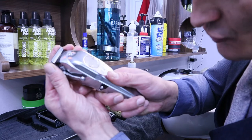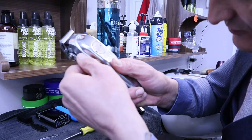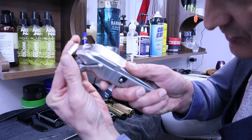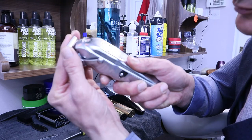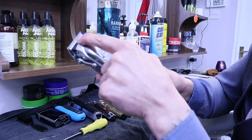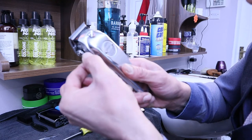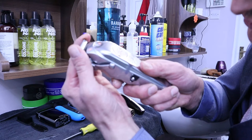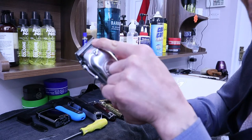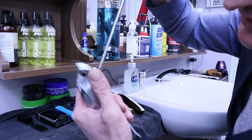Make sure the blade is in the middle of the guard. This is all the way to the front so you can see where your blade is going to be. Once you're happy with the blade level, double check the back level as well — use the guard as a reference. Moving it back and forward will show you where your blade is, especially on the corners.